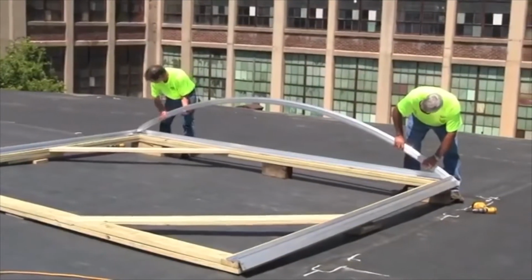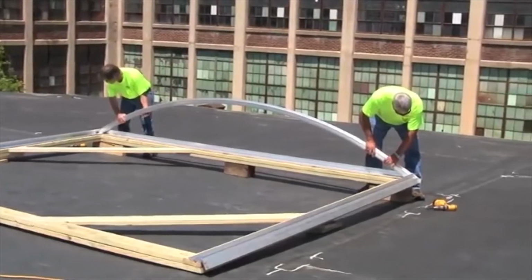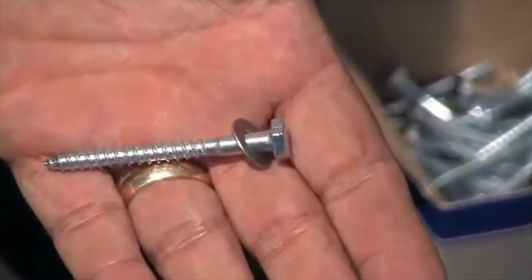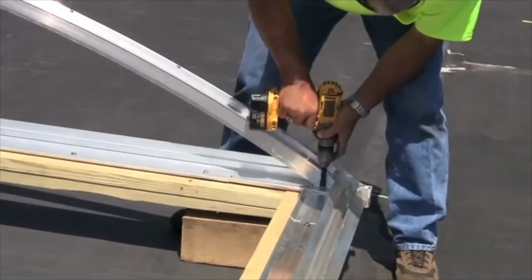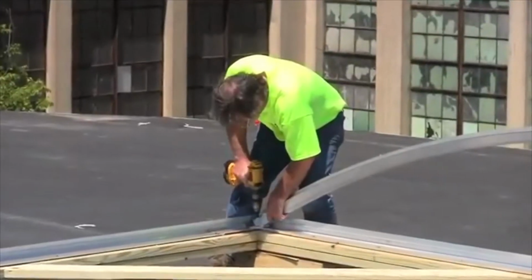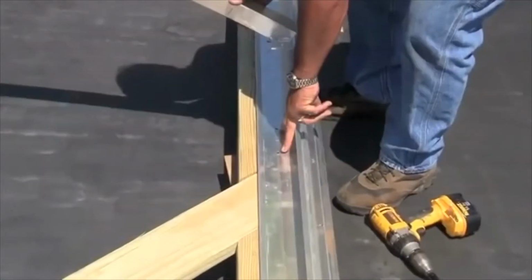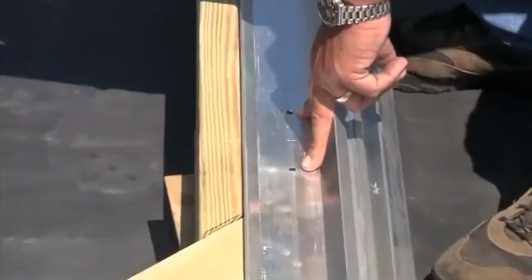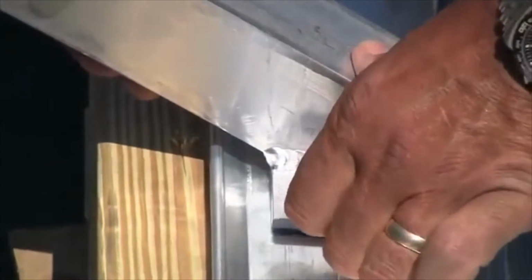Starting from one end, install support ribs. The vertical end rib will have a screw groove attached. Install anchors through rib anchor plates and pre-drilled holes in the pivot sill base plates. Align the holes in the rib anchor plates with the pre-drilled holes in the pivot sill base plates. Drill pilot holes and install anchors.